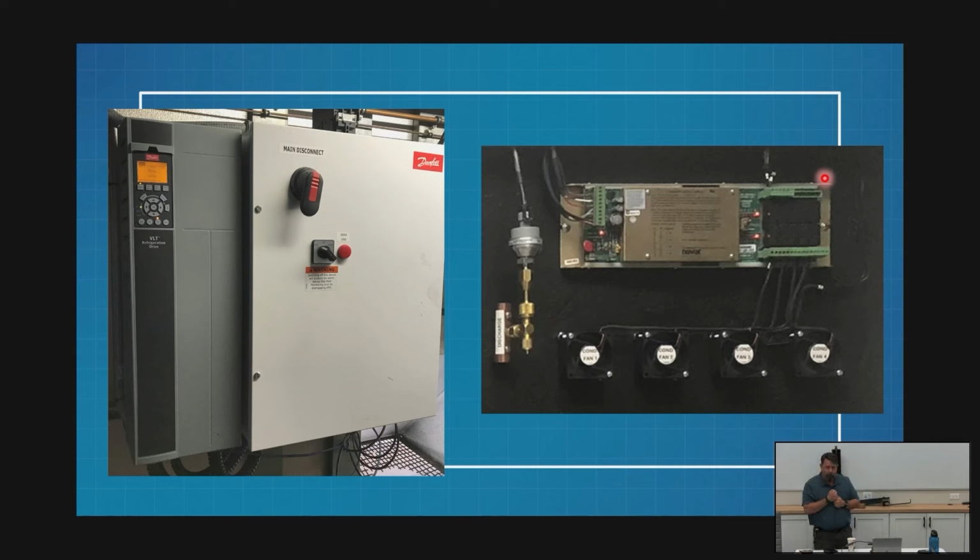So they fail on. If I take away my control and it's a normally closed contact, it's going to run. Yeah. All right, so all of my condensing fan motors are going to be wired that way so that if I lose control, I've got 100% fans. Well, if it's January 17th at 2 o'clock in the morning and I can't have 100% of my fans on, yep.